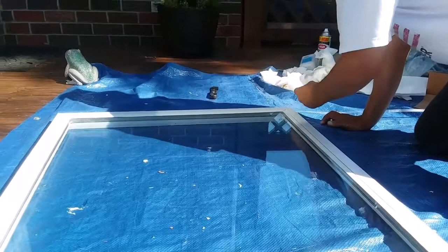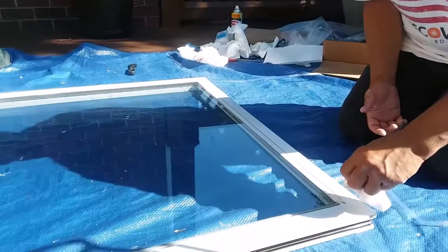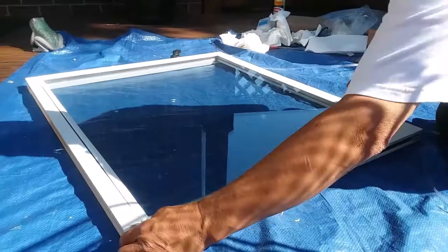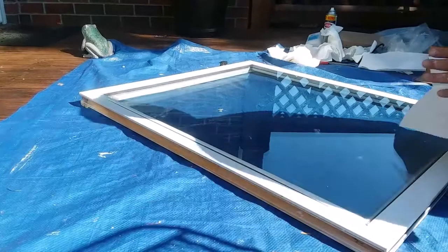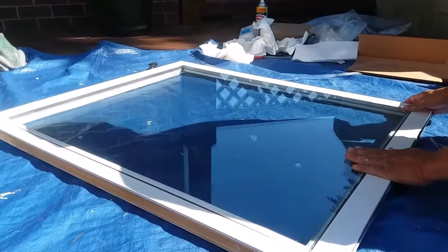This Krylon paint — I sprayed it first and probably let it dry about 30 minutes or so before I flipped it over to paint the other side, and that was enough time where it didn't give me any problems. I'm cleaning up some of this caulking that's on the glass while I'm at it because the wetter it is, the easier it wipes off — so it doesn't dry and cause me a problem. Okay, I'm down to the last side here.